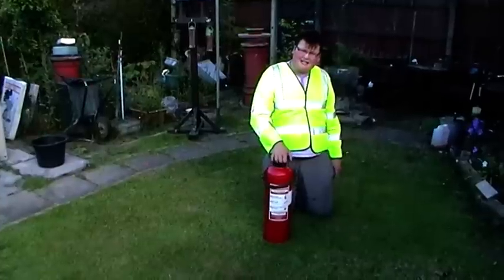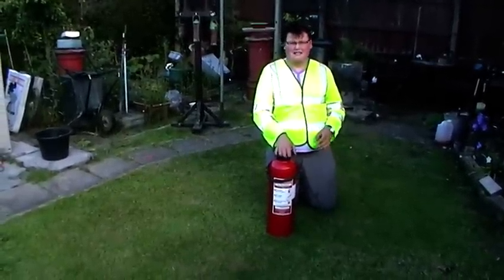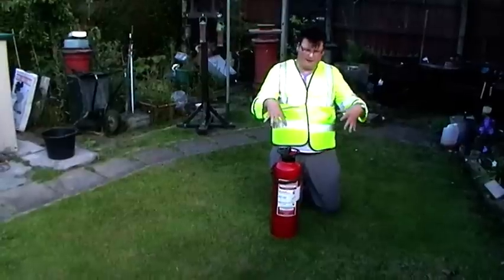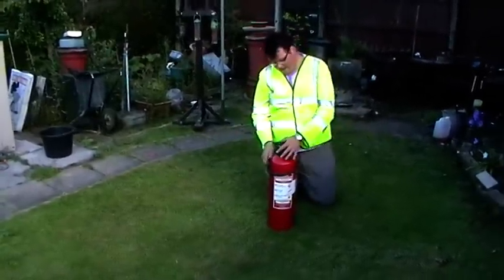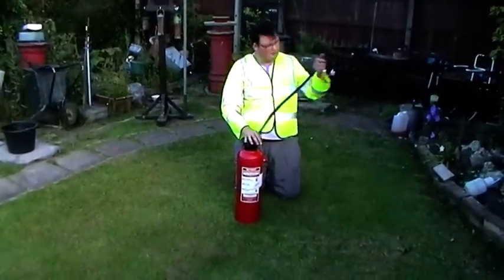The pressure charges came in CO2. And on the other video I'm going to show you the wet water charge, which has a sealable bag at the bottom — when the cartridge pierces, the bag bursts and mixes with an aqua spray type liquid. Another feature on these was the fact that the hose: one was long, and two had a spray.